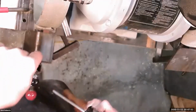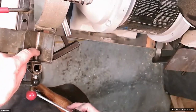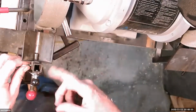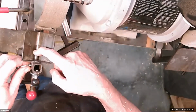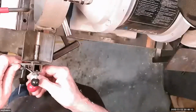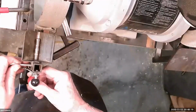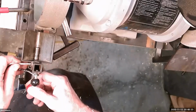Now all I need to do is place this, which is a Don Geiger add-on. And one of the reasons I like it is because it has this movable pin. Don's changed this a little bit around now. Now it has a block that goes in here. But this is set up for 60 degrees here. If I advance this up there, now I get about 50 degrees, and if I go on up, I get about 40 degrees. So that's the way I make my three bevel cuts.